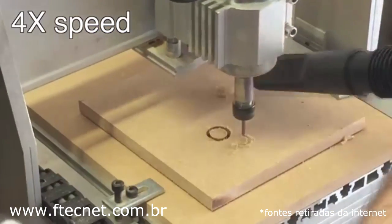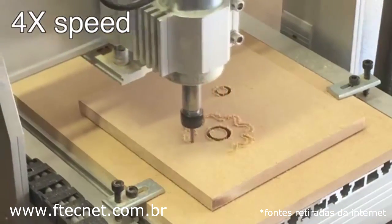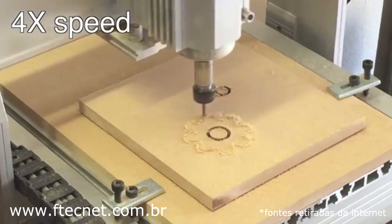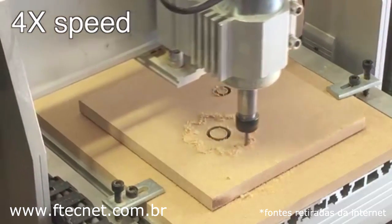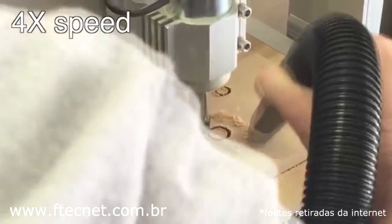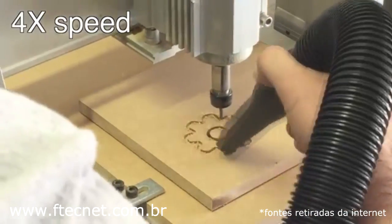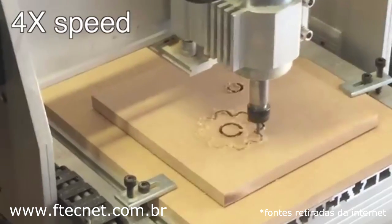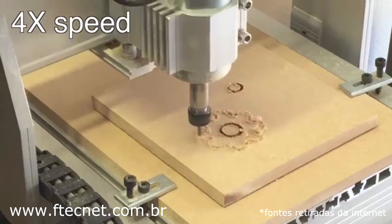This is all done by the use of the G-code that was created in Cut2D. I actually made this whole design in Cut2D. I imported a graphic of a gear set, and then I traced it using the trace feature included in Cut2D. You have to import BMP only, but then after it's imported, you can trace it in Cut2D and it will actually make the outlines for you — then you just proceed as normal.